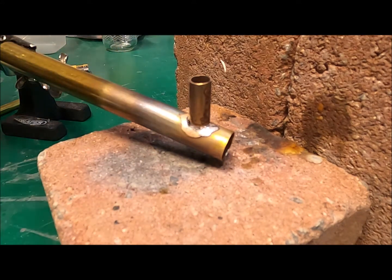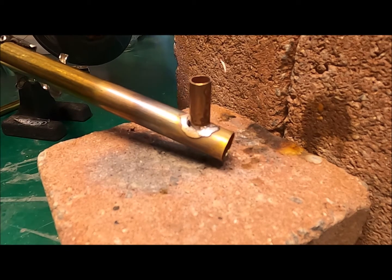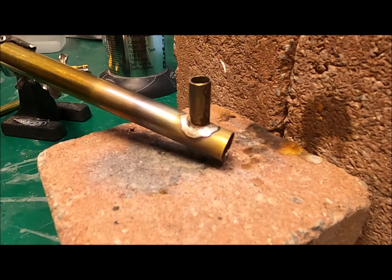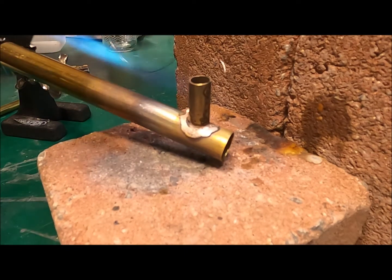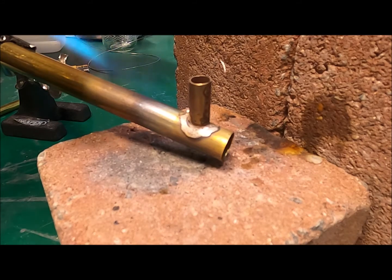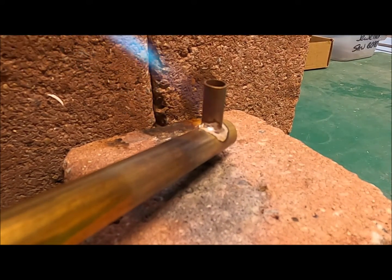There's a little gap on this side. It would be nice if it would flow into this one, because it doesn't look like it's running to. What I'm going to do is add just a little tiny bit of silver solder again from the rod, and see if I can get that to melt into that. I've got to heat those bits of pipe as well. There's the solder in the middle - it's just starting to flow. I think we have it.